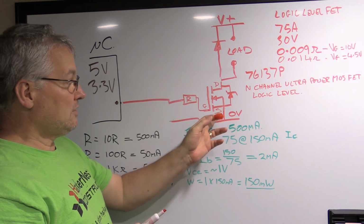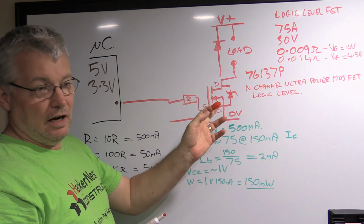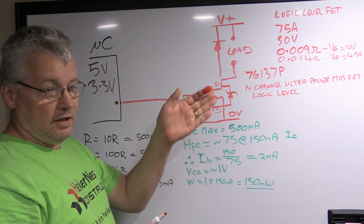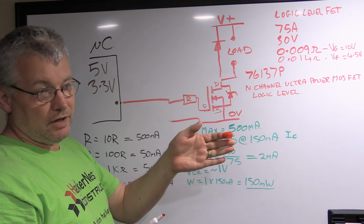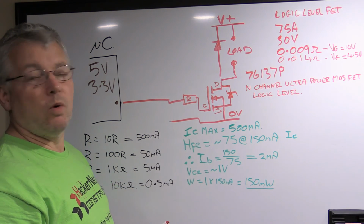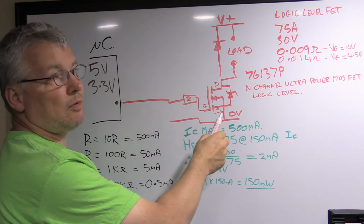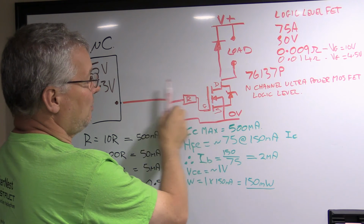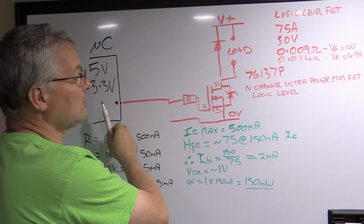This FET, I've actually got one of these that I'm using in my kitchen. I don't have a heatsink. It's just put on the circuit board. It's just soldered straight in. It's sticking upright, so it's not even in contact with anything for the tab, and it doesn't even get warm. And it's driving probably 5 amps easily. So from a control perspective, you've got a microcontroller.